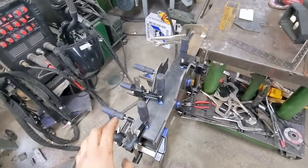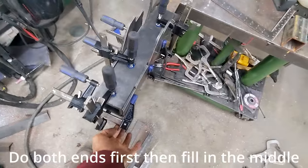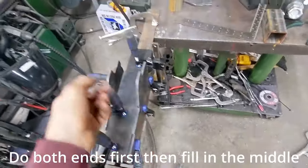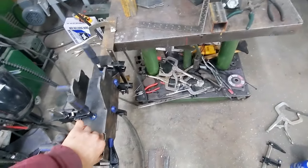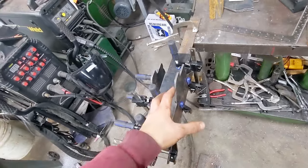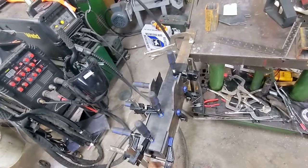Now that it's all clamped together, we want to tack this and then get it off the pipe so we can get the wires out before we weld it fully — otherwise it'll shrink and we'll have a terrible time getting it out. Tack and weld around in a circle: tack here, then move front a little bit, do a tack, around in a circle, and keep going until you have tacks every two or three inches the whole way up. Then we can take all the clamps off and hammer the tube out of the middle.